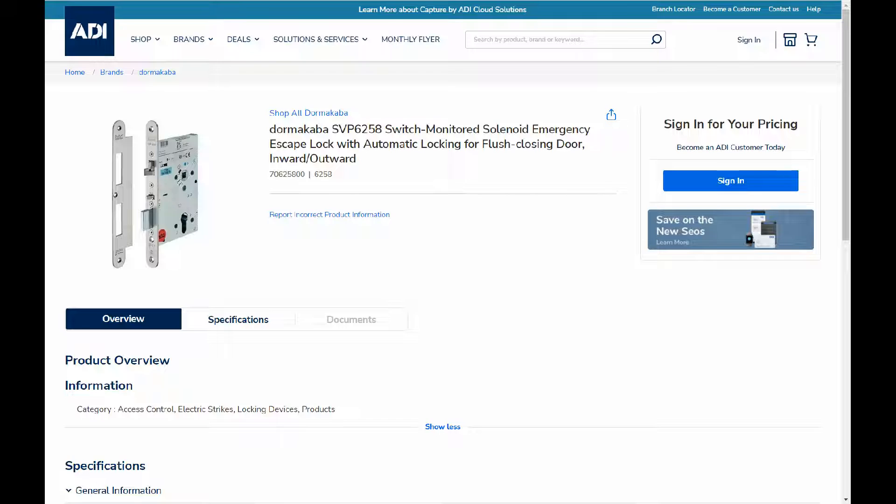The lock itself is like a traditional sash lock, so you have a latch at the top, deadbolt at the bottom, deadbolt controlled by the key on the outside and the handle controls the latch. What makes this different than normal sash locks is the external handle is electronically controlled, so when you connect it to an access control system, without granted access, the handle is free — it doesn't engage the latch.